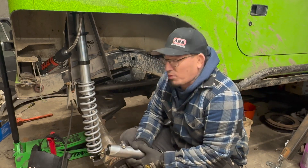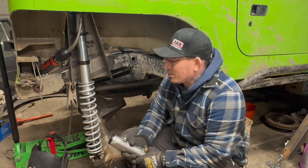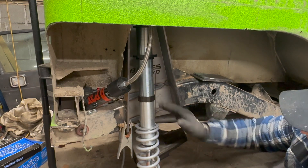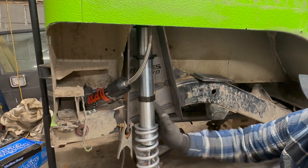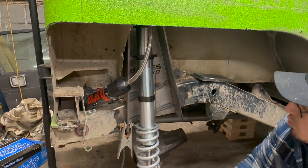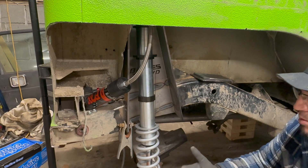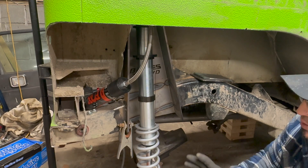I like things to look a little bit more thought out. So now all I really got left to do is get the welding done and figure out getting this thing mounted, and then we can move on to the limit straps. Right here you can see I got a line on the back of the tower. That line is there because I've already measured under articulation, full droop, everything, to make sure this line is going to give me enough clearance from the spring. I triple-checked this and I know it's going to give me quite a bit of space. So if I box out up to that line, I know I still have room between the coil and the side plate, so if I need to make any adjustments to the axle and pull it forward a little bit, I've got wiggle room.